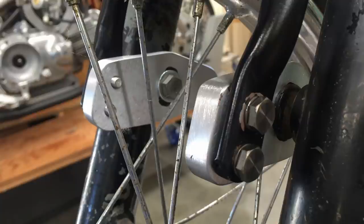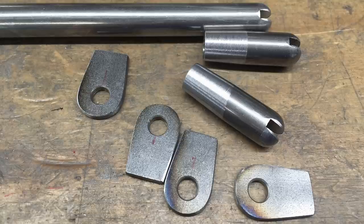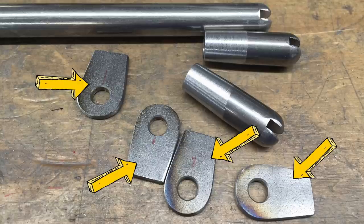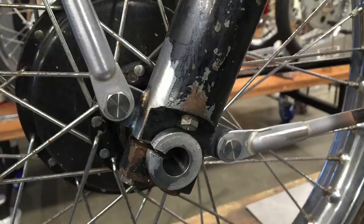Here you can see how the brace mounts with those 2 pieces. So it bolts onto the fork, the mount comes out, and the fender mount fork brace mounts on. There's the bolts bolting into the 1/4 inch national fine tapped holes. Here we go. This is more progress, and I've got the 4 end pieces done, and these slot into there. And I put them in, I did a TIG tack on either side. And this is the final product.